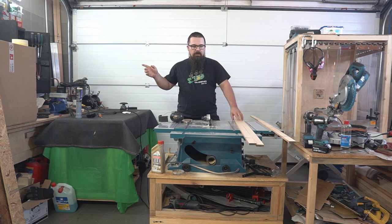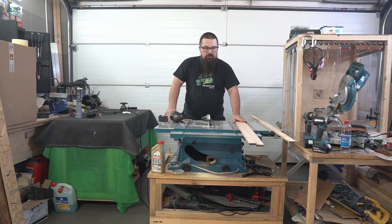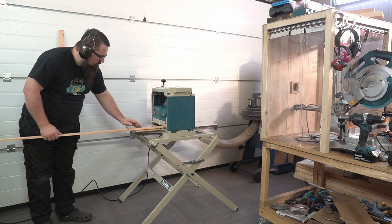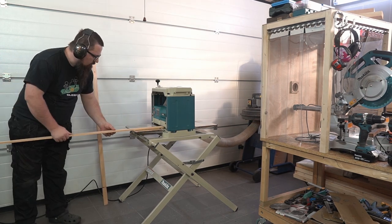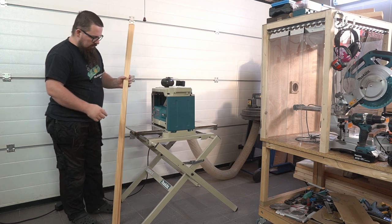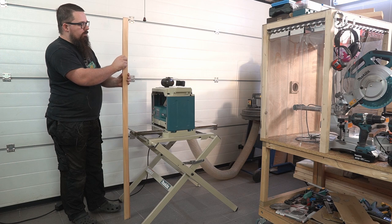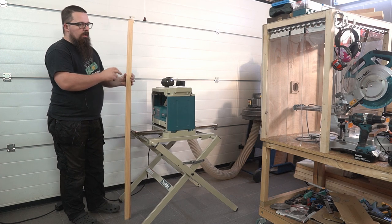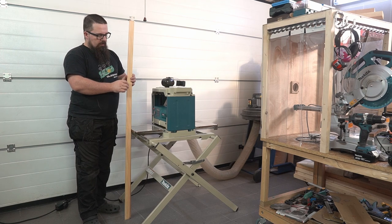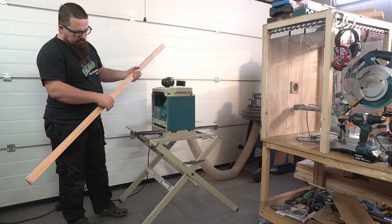Wood is done. Primer on the main steel element is drying, so now it's time to make them thinner. My two wooden elements are ready. There's one important thing when you use a planer: always plane both sides. Otherwise you can create some tension inside the wood. Even if the board was straight, if you remove too much from just one side compared to the other, it will start bending. Maybe I will trim it a little bit more — we will see.